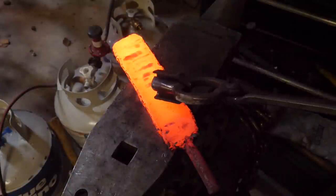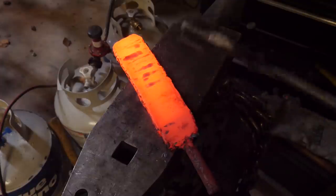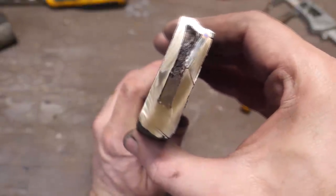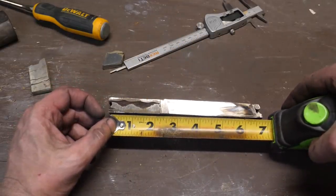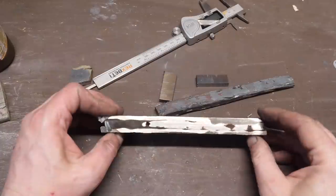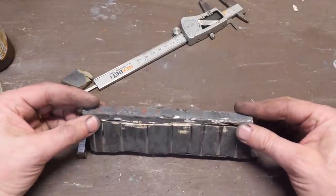As you can see, if we're quick with it under the dies, it doesn't really lose that much heat. While I was forging it, I felt a pain right here — something right in my chest area. A little bit worried about that. Now that we've cut it open, there are two problems. First, the billet is not as long as I thought after cutting the ends off — I need seven inches and we've got about six and a quarter of usable material. The next issue is wavy dimples in there that I really don't want to grind through, as I think that'll lead to warping. I've marked the outside of the canister on where to compress to flatten those.